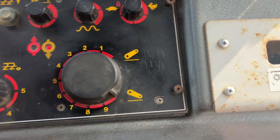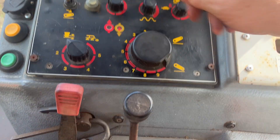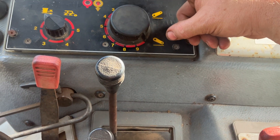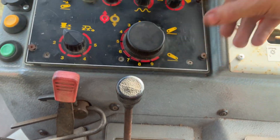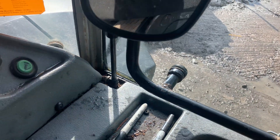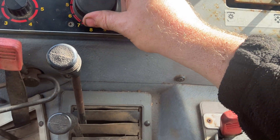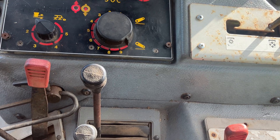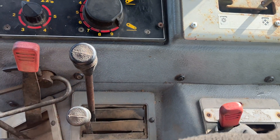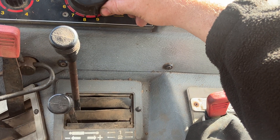Those are the buttons across the top. Then you've got this large knob — when it's in the down position this controls the height that the minimum is set to. You could even have it almost at full height and it'll lift the link arms to full height, but it's this knob that's setting the height. If you're grading some soil you can set the grading height; if you're plowing you can set the plow to go to a certain depth.